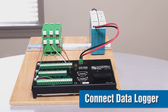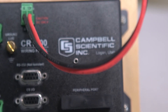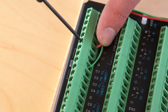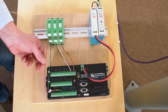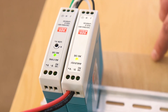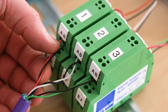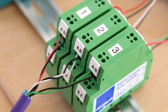You're now ready to measure precipitation. Before placing the cover on the gauge, connect the data logger to the sensors and listen to make sure they're humming and giving you good data. We're going to be using the CR1000 from Campbell Scientific, using pulse counting to measure the frequency, and we're also going to power the sensors from a 12-volt port on this logger. The sensors are powered from the Campbell Scientific data logger's 12-volt port, which we have connected here, linking them together to supply power to all three sensors. The power to the CR1000 is going to come from a converter outputting 12 volts DC. Sensor number one is red and black, sensor number two is white and black, and sensor number three is green and black, connected to the proper ports on the signal interfaces.